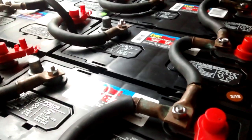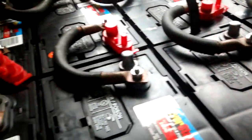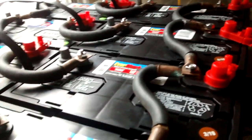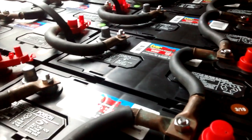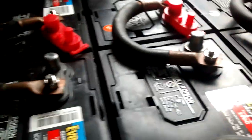Potentially you could have more than 20 here — you just keep buying these and hooking them up. Now, these are all different ages because you can't buy this many at one time. I had to make multiple trips across different states. And this is the first time they've been hooked together. When you do lead acid, you want to do it all at once — you don't want to be adding to it.